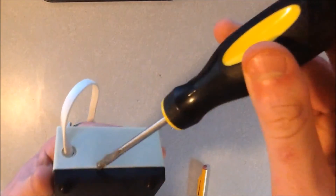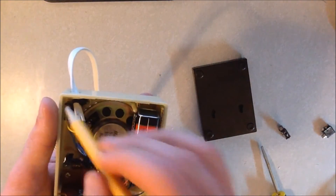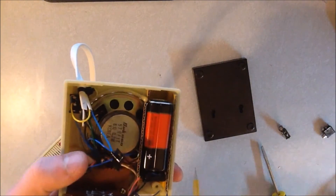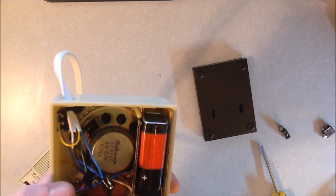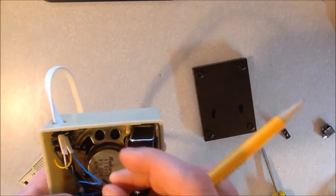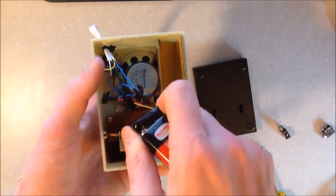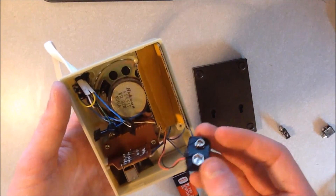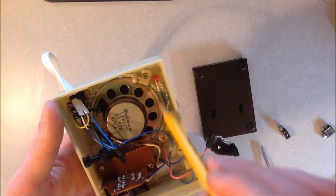Over on the remote: the yellow wire is running over to the switch, with a blue wire coming off that switch tying the green and the other blue that runs over to the LED. The white runs to the switch and in this instance instead of red it is brown, but that's connected in the switch. The black wire is wired straight over to the other device, and this blue wire is wired straight to the LED. The battery pack is here - I didn't have a connector for it so I tied some wires together; this was from a dead 9-volt battery. Underneath is the LED and a resistor.